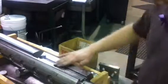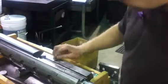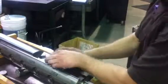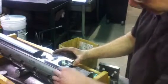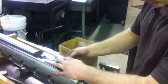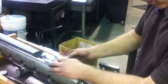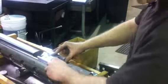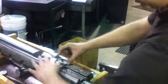So, I've tried a couple different things and tried to figure out what to do to fix this. Anyway, it seems like this T-slot has a sharp corner up in this one end. So it goes in nice right here, and even somewhat clamps the cutter knife. So the screws will pull it down. But it won't slide. It gets extremely tight.